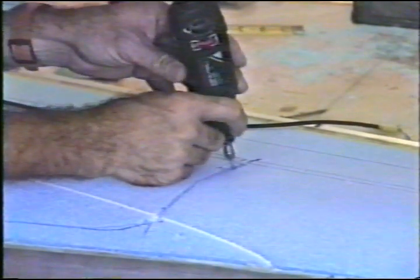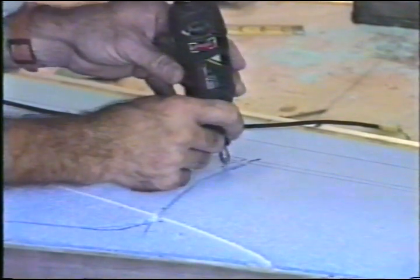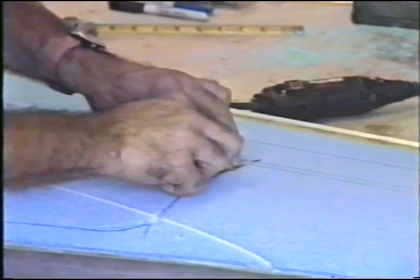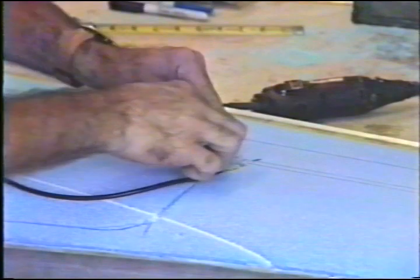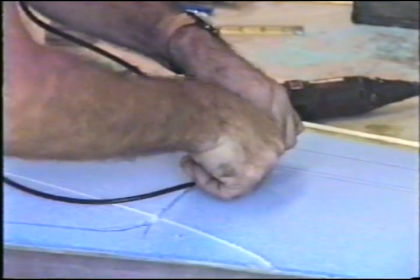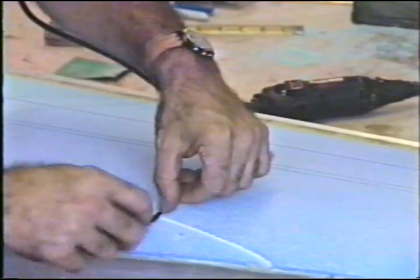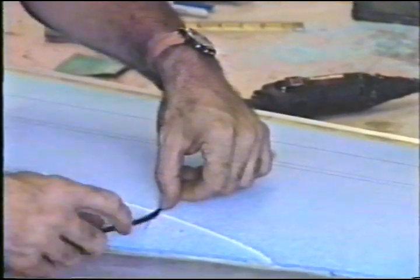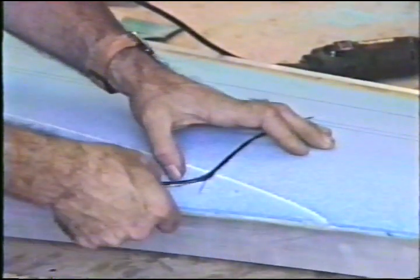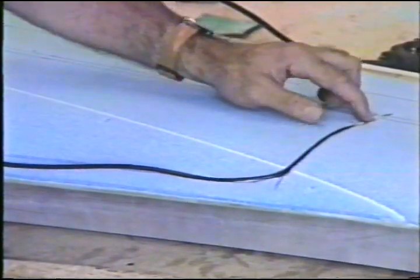Once you get it to fit, you don't have to put epoxy underneath it. I make this a close fit so that I don't have to fight the toroids rising up and putting a lump in my epoxy. I keep having and then reliving the old fears from a hand laid up wing that is not vacuum bagged. When you vacuum bag, a lot of this is taken care of because the vacuum bagging process itself pulls all this stuff firmly into the core, usually leaving a depression, not a raised area.